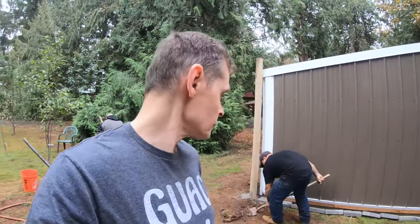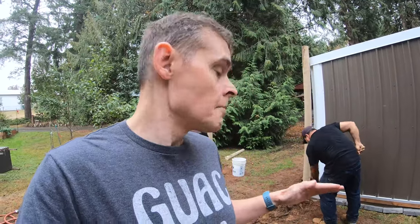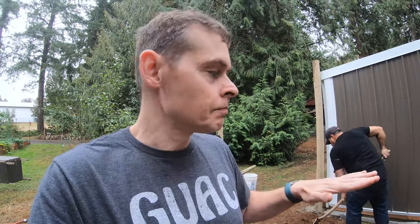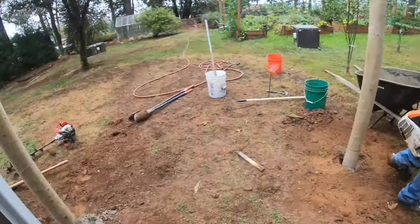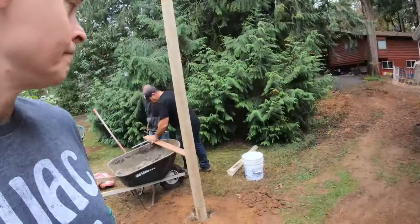This is why I really like working with professionals. They have another really great suggestion. We're going to cement that first paver right down there with the post itself, but we'll also use some cement to create a slope so that it's basically its own splash block, directing the water out into the yard rather than back under the building. And the pencil? Yeah. They're going to create a little form for the concrete.